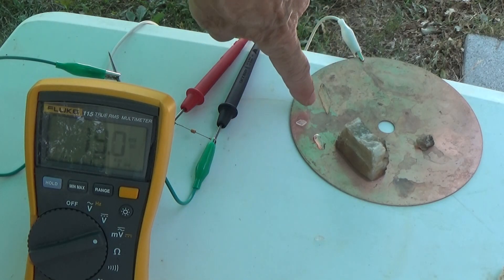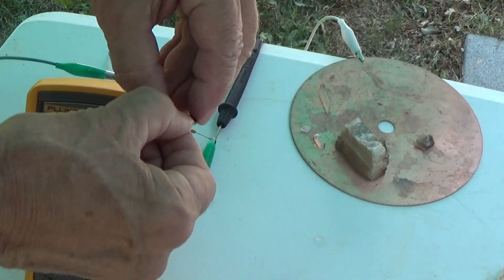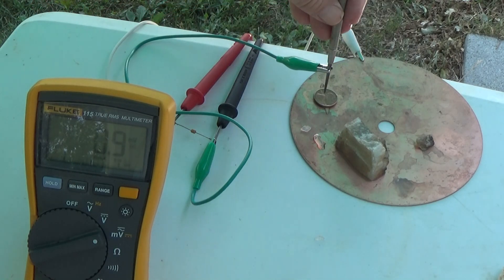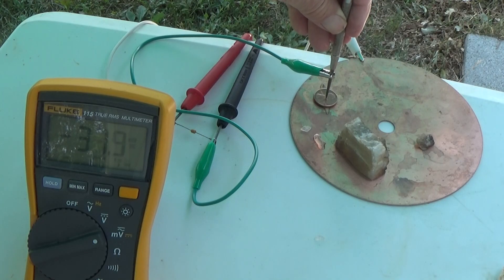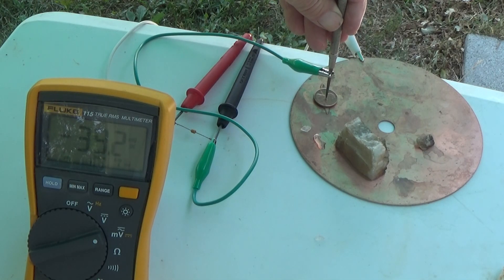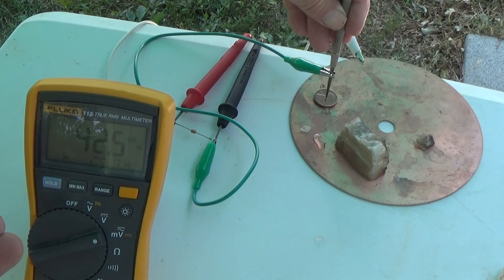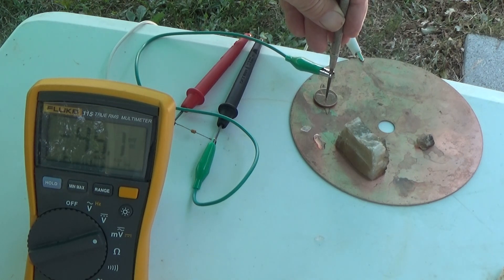The crystal is the anode. The plate's the cathode. I'm going to give it another cathode. We see a negative voltage because the black lead is at a higher potential than the red lead, so the multimeter reads a negative voltage. Looking at the AC voltage at that point, that's about 42 millivolts. And sure enough, there's the DC voltage — just the top half of the waveform.